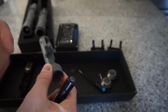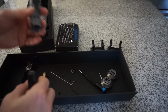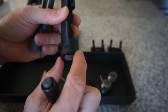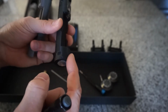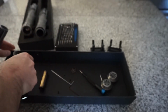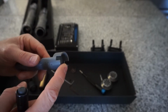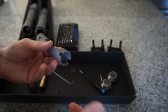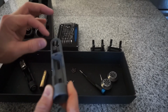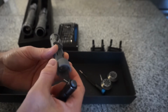Get your battery in. Now at this point, like I said, it should be a snug fit. It might be a little loose. And the speaker itself, this lip of the speaker will be larger than the chassis, right? So you'll Dremel with a drum wheel to make that flush. Then I'll run that up, but I won't glue it in yet, right? Because in case maybe you have a bad speaker if you haven't tested it, I leave it unglued with enough slack that I could pull it out and do whatever repairs I might need to do.